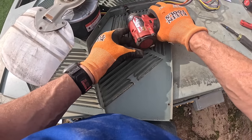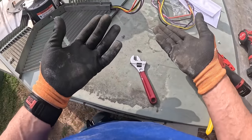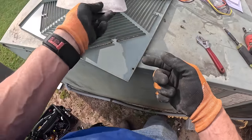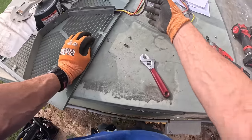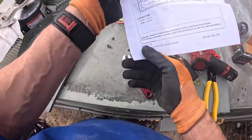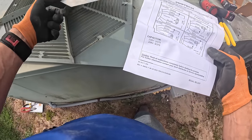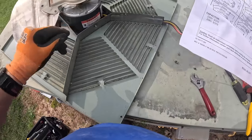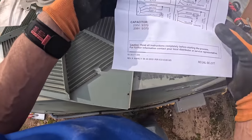So what you actually do when you wire these is you can reverse your start and run winding, which is what you're doing when you're changing the reversing wires on other motors. You reverse two different wires, and I'll show you here. All right, we want this thing to run clockwise, shaft in, so counterclockwise lead in.